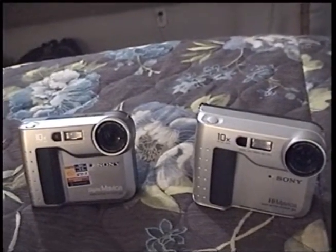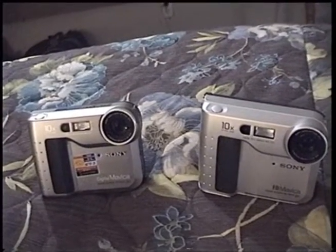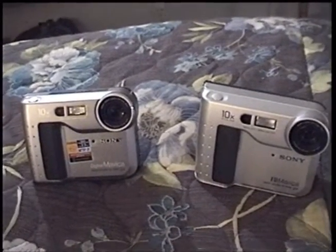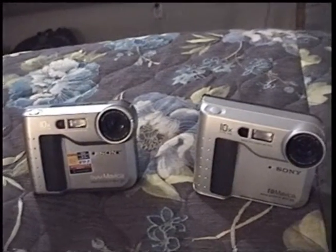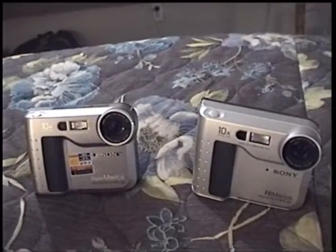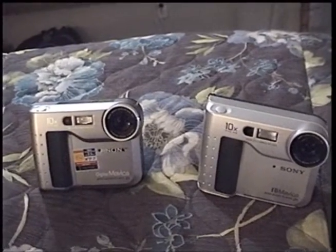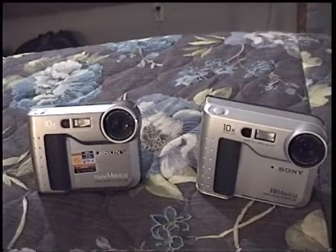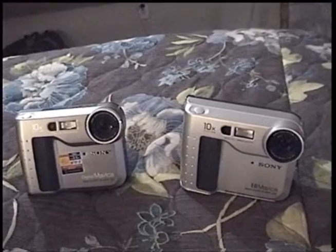One thing in particular that I'll mention, I had wondered if the reason the quality of the pictures from these cameras is so darn poor compared to a newer camera taking a VGA resolution picture might be because the camera actually takes an interlaced image. It scans the image in interlaced form. It basically takes an NTSC video frame and makes it a still photo.